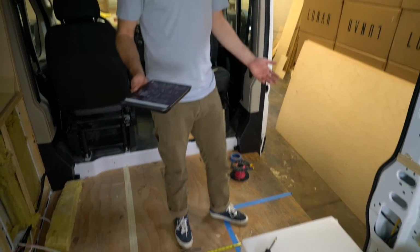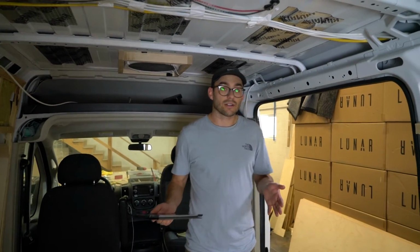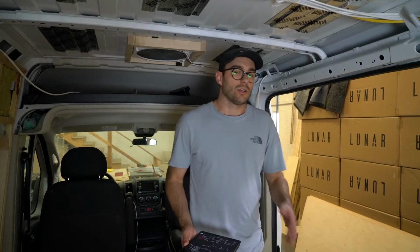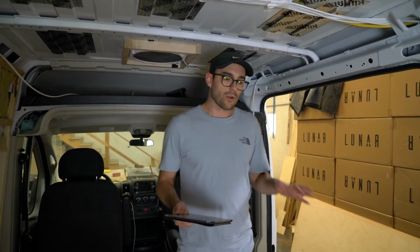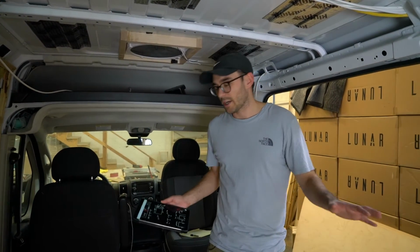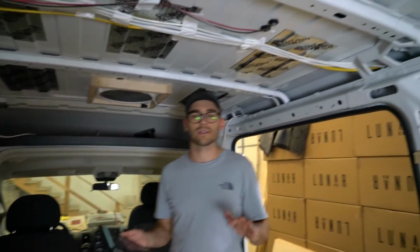Well, a good thing to do before you start building your base cabinet is get your sink and put it in this spot and layout and make sure you have enough space for your drains, for your faucet. So before you even build the base cabinet, just get this rough layout in, bring all your components in here, rough draft it and make sure everything fits.